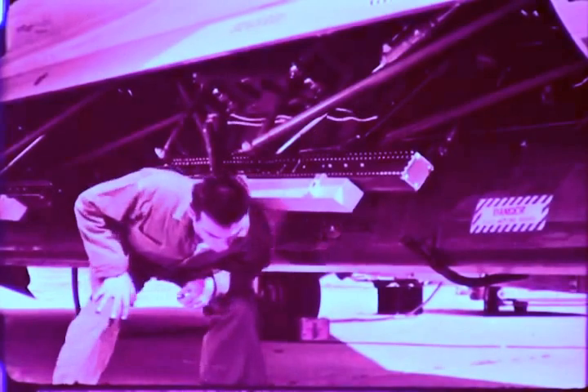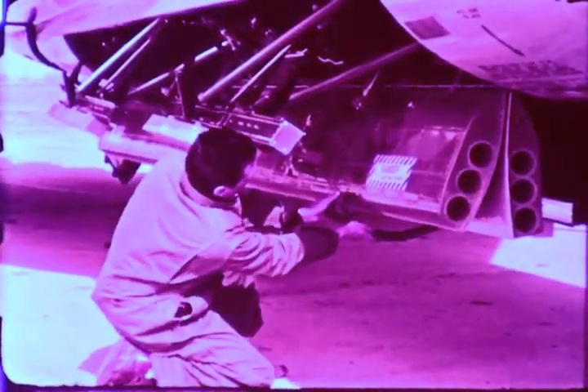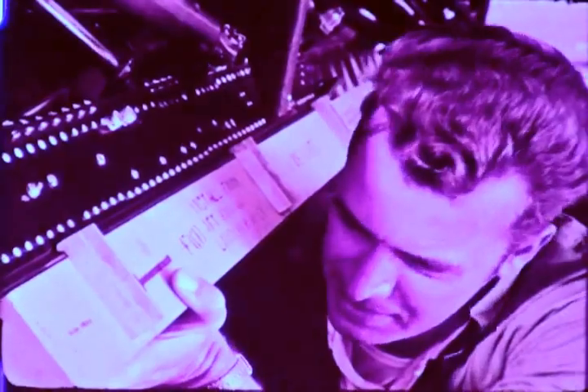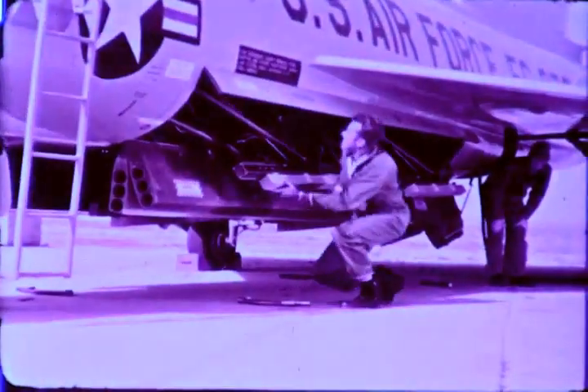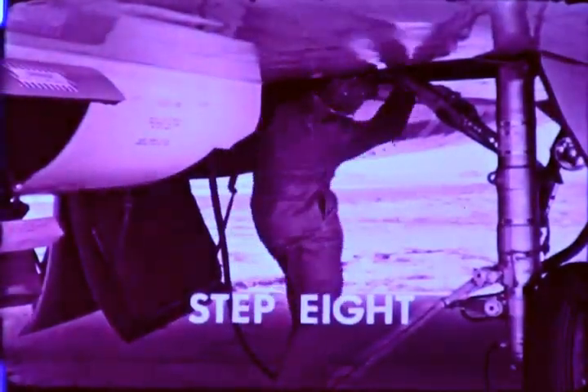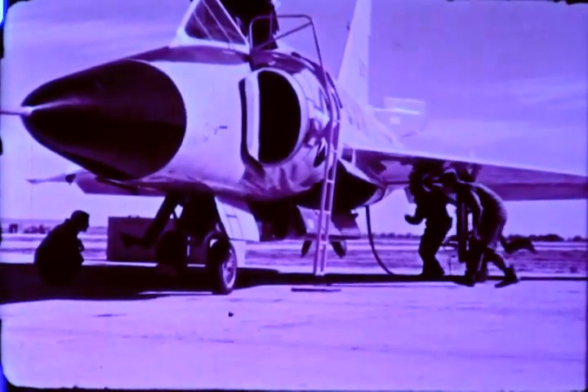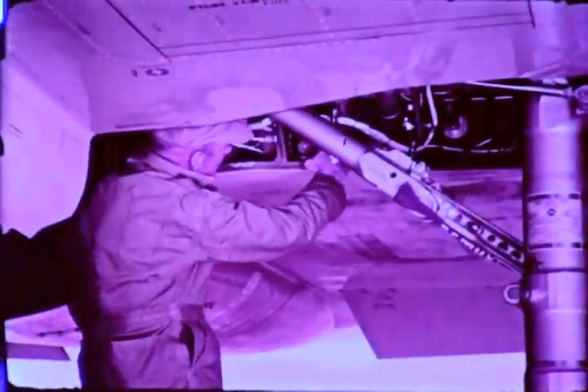This is step seven. If any launcher can be moved, there is no snubbing air in the system. Do not retract launchers until the trouble has been corrected. The only positive way to check for snubbing pressure is to apply physical force of approximately 180 pounds to the front and rear launchers and the doors. With snubbing checks complete, we are ready for step eight. Make sure all personnel are clear, then retract the launchers. Snub check the doors before retraction.